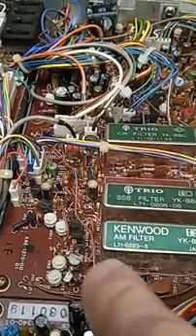I tend to clean the old flux off these boards. Isopropyl alcohol is a solvent for rosin flux, but toluene works better. I had to clean down the side of this display board with toluene — isopropyl alcohol wouldn't touch it. Toluene is very flammable and it smells too, so be careful. Use that procedure to almost eliminate any chance of mistakes, because with 125 parts there's a big chance for error.